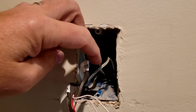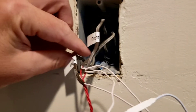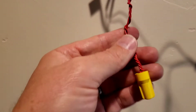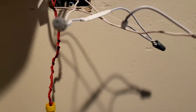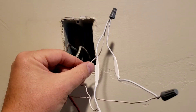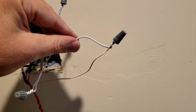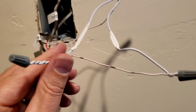One wire goes directly to the transformer down in the breaker panel. This wire goes to my front door. This wire goes to my back door. They're all just two-conductor wires. So these red wires I just wire-nutted together — they're all just connected. And then for the white wires, the one coming from the transformer I wire-nutted the little resistors straight into that one, and then each end of the resistor cable feeds out to each of the separate doorbells at the front door and the rear door.